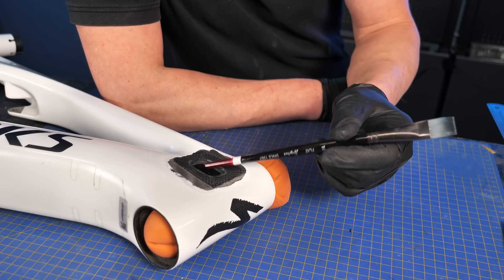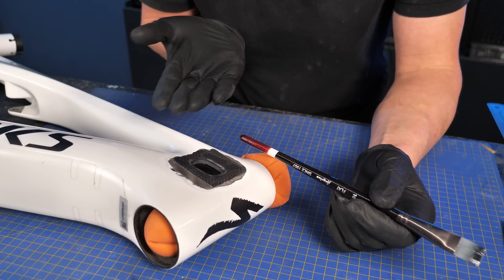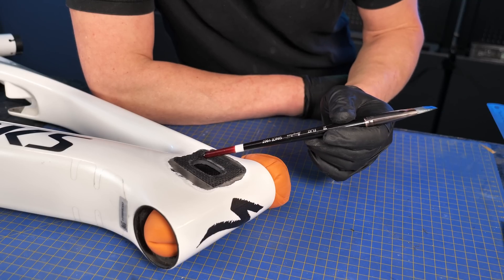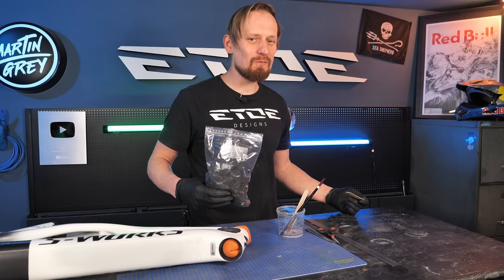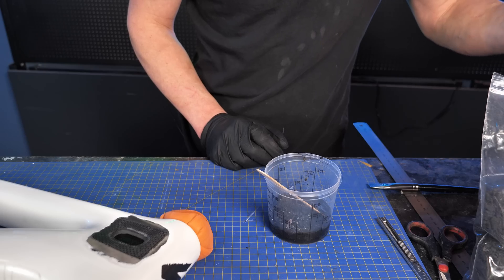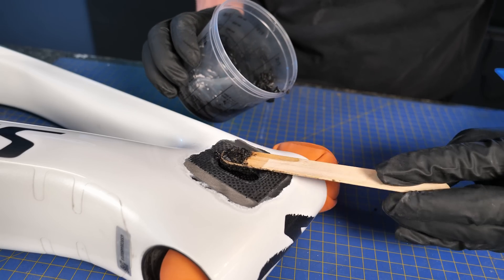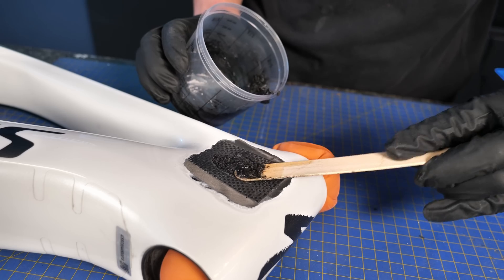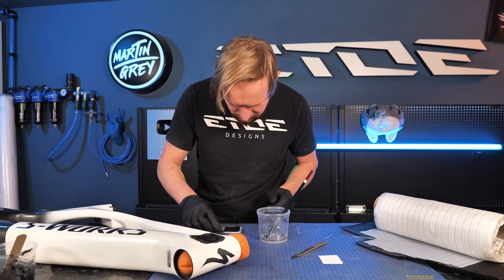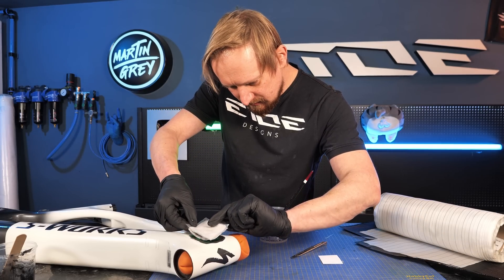Let's check — yes, we have enough pressure. The patch is pressed against the frame, but we have the gap of the thickness of the frame. What I like to do is fill this gap with shredded carbon fibers. I'm adding these carbon fibers to my epoxy resin to create a kind of putty. I mix it again and with this putty I fill the gap. I've created the second patch in the same way as before, which I apply on top — like so.